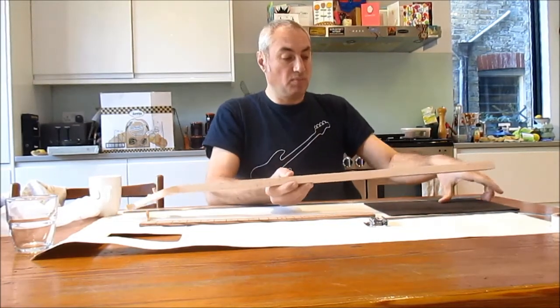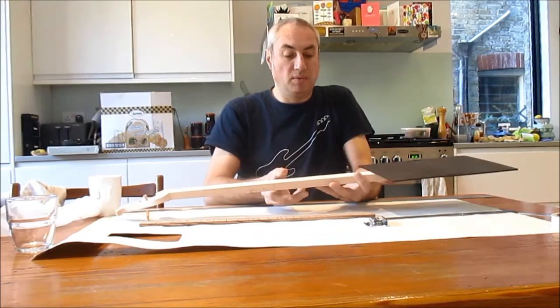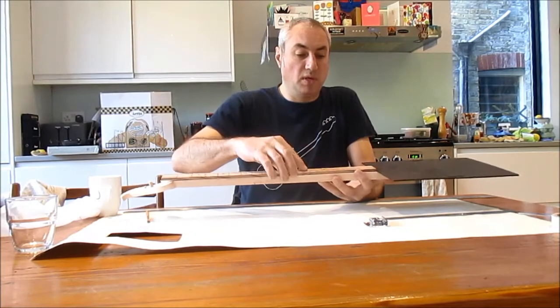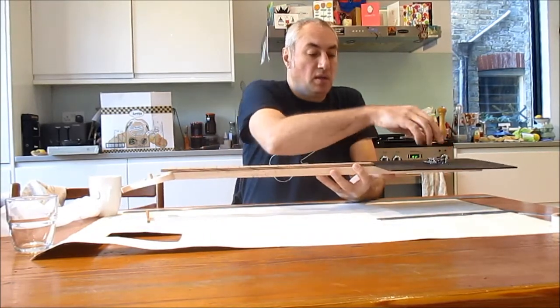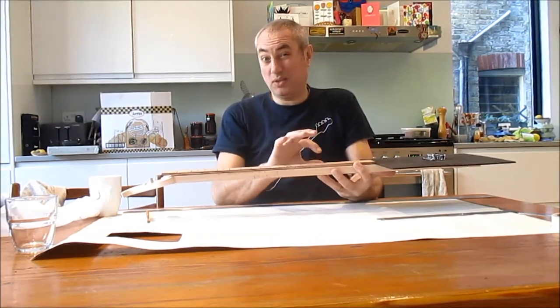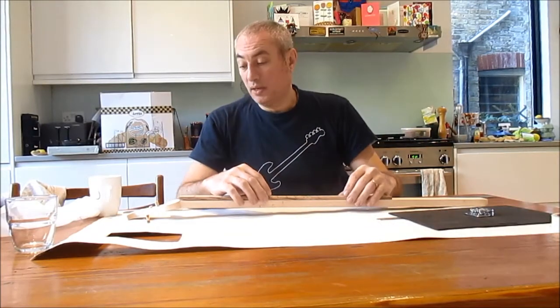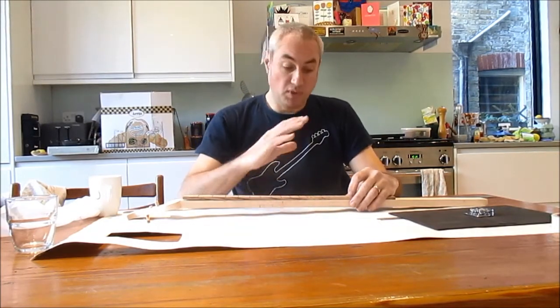basically just build a straight box type arrangement where you put the neck up onto the box, then you put the fretboard here and you stick a bridge on there, you'll find you have quite a high action around here. You'll have about 7mm or something like that, which is fine for a lot of people, and a lot of people like it like that. It's good for slide.